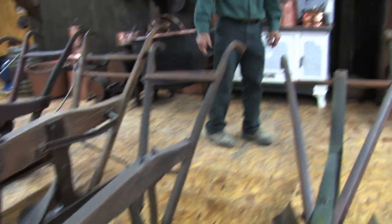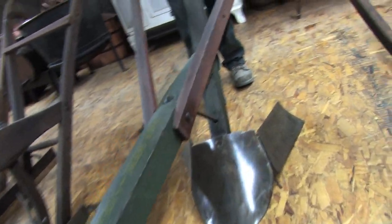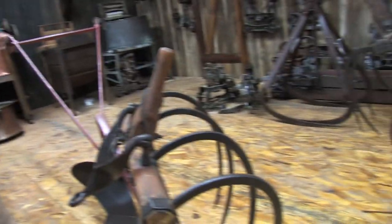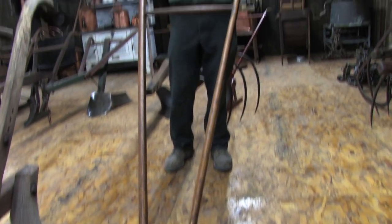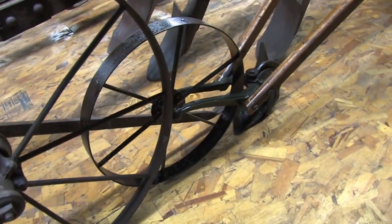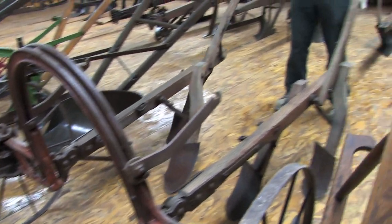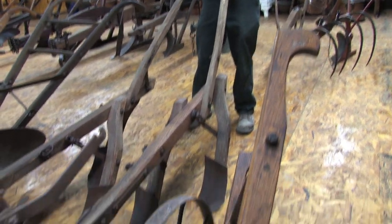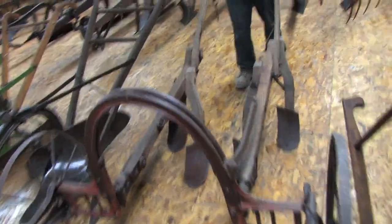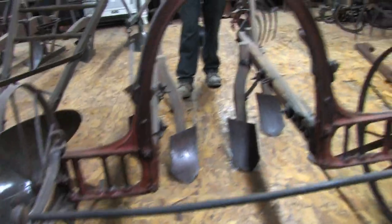This is a smaller pony plow — an original John Deere. It's a lister plow, followed by another pony plow and then another pony plow. This is basically a little plow you'd use in the garden for putting in a row, whether it be peas or whatever — that was just a hand cultivator. This is a horse-drawn cultivator. You steered it with your hands, moving the shovels in and out. If your horse was a little off to the side, you could move your shovels to get back and forth. Totally wooden frame, except for the steel on the wheels — a very, very early cultivator.